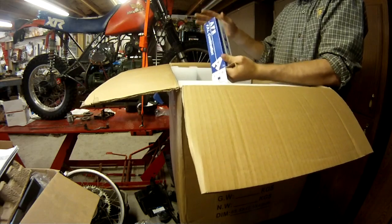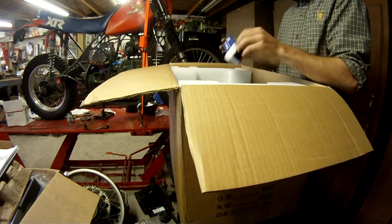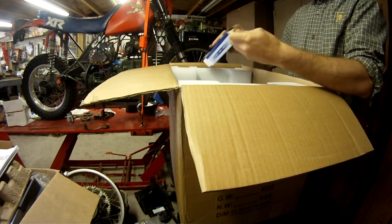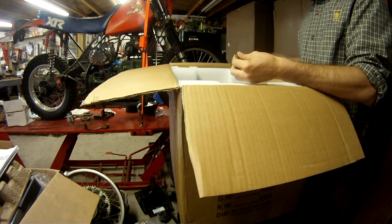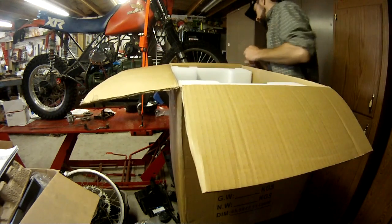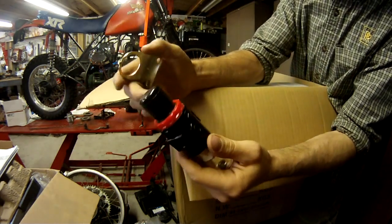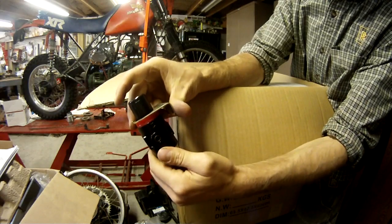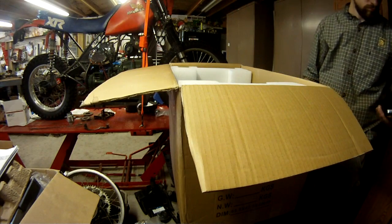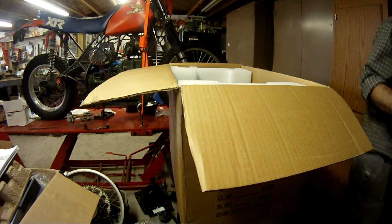So yeah, I guess I was saying that I wanted one of these multifunctional machines just because they're so versatile. And being that they're inverter based, they pack a punch for a small light package. There's a bracket that goes with the air separator, but you can get some really awesome current rating. You know, this is 200 amp TIG and stick. That's quite a bit of heat. You can do some serious welding with that, and yet it's in a small package.